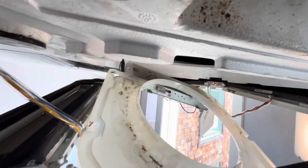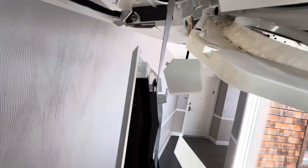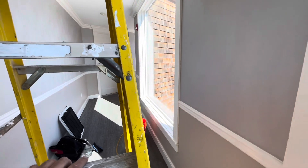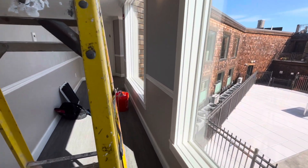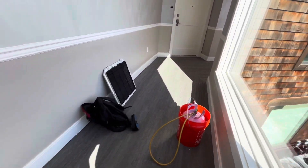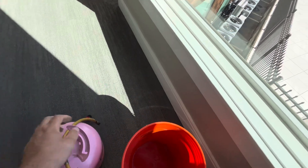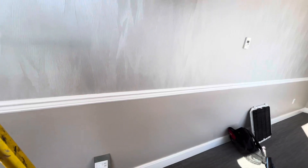What I'm going to do to drain the pan right now is open this with my bucket underneath it. I know the pump's good — well, we'll see if the pump's good; it could be bad out of the box too. But let's see if we can get the water out and then go ahead and try to clear out that discharge line like a normal condensate pump to avoid that P5 error code.